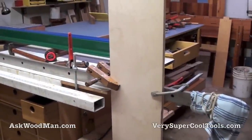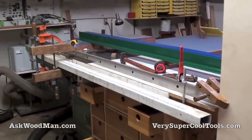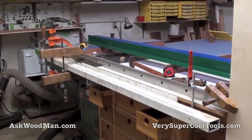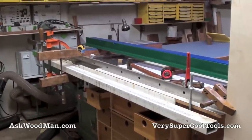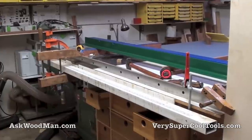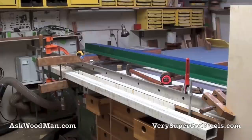The day is here that I'm going to pull off my old Biesemeyer guide rail - my original one that's now bent after locking my T-square down to it a couple hundred thousand times. I'm going to put on the new one I've made: the green back there is angle iron, three by three by a quarter inch, and the blue is the new two by three eleven gauge tubing. I've got everything pretty much ready to go.